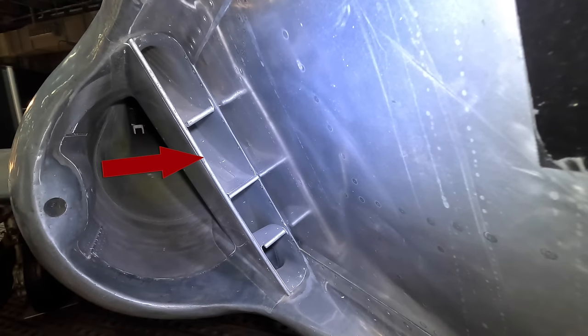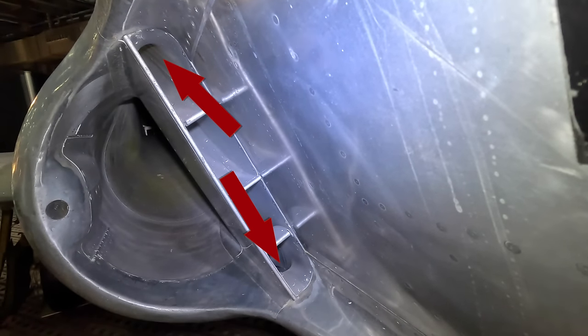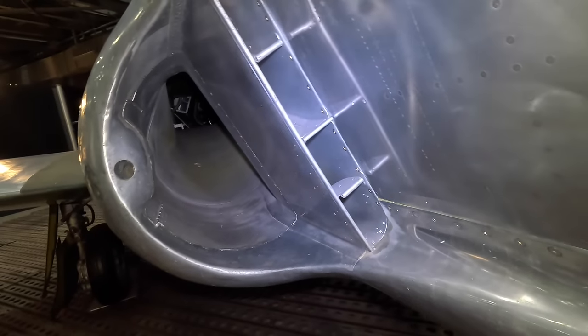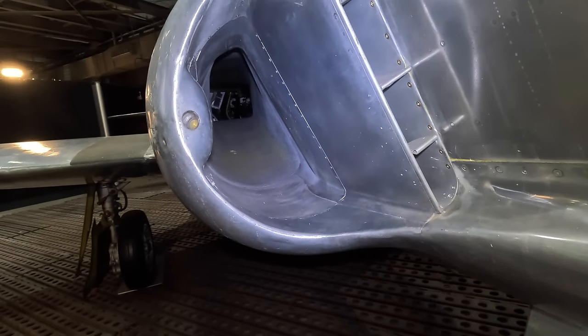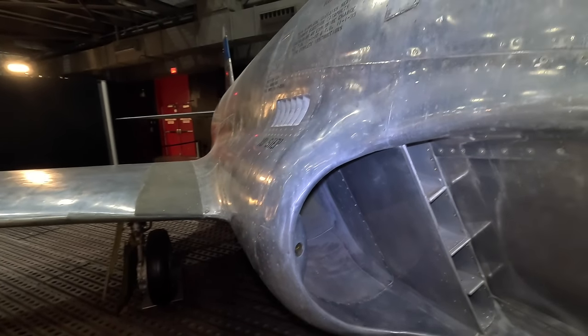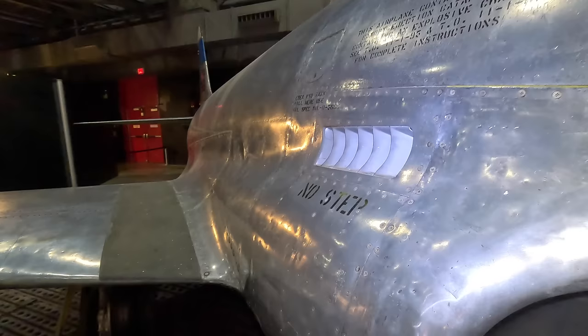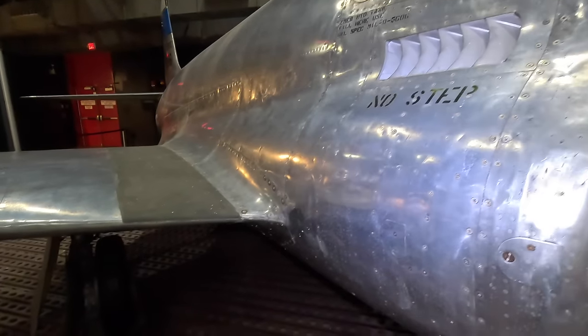This section removes the fuselage boundary layer of air and expels it up and down via these holes you can make out here. The air is turbulent, and you don't want that entering the main duct. Of interest, the British engineer who delivered the engine warned that the inlet duct's skin was too thin and fragile, but their concerns were ignored. Both ducts ended up collapsing and were sucked into the engine under full throttle testing, so then much thicker skins were installed. This vent here is where the boundary air is expelled.